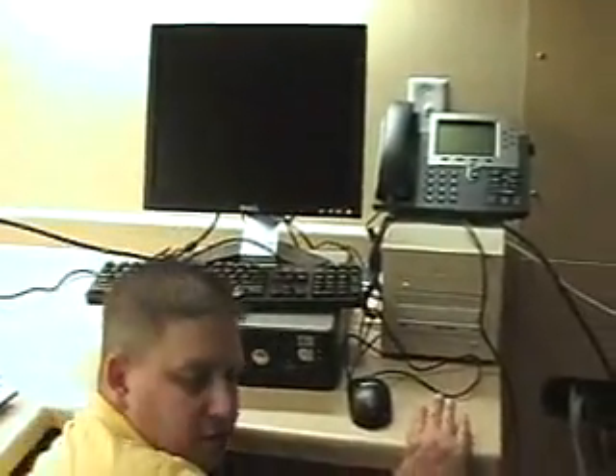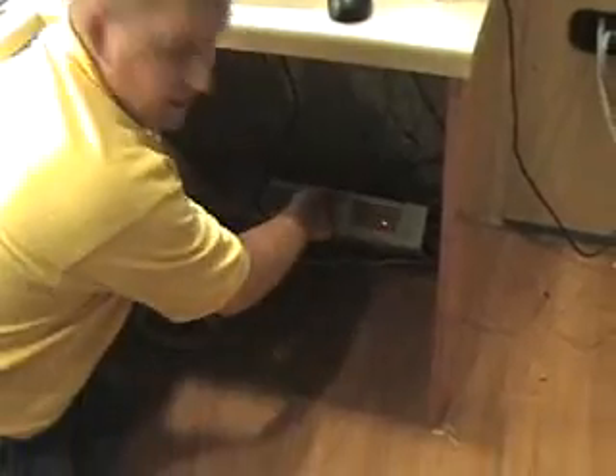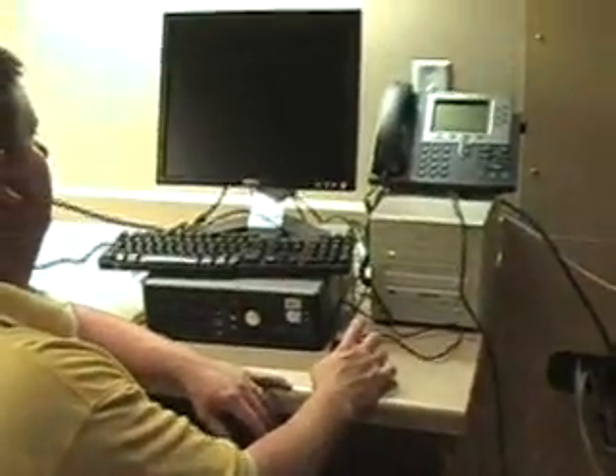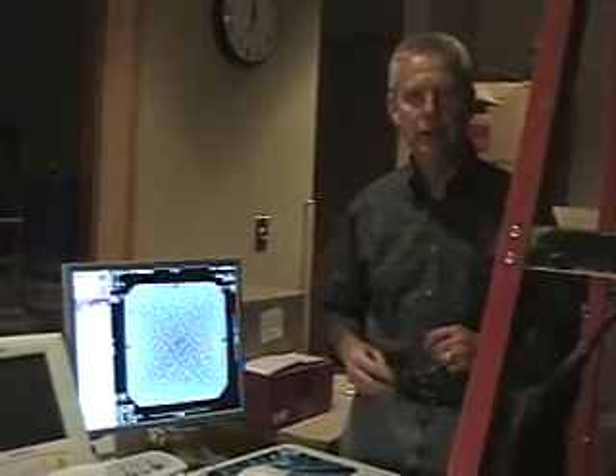While we're powering everything on, switch the power supply on as well. When you turn the power supply on, what you want to see is a red glow inside — that tells you the power supply is on. If it's flashing or chirping of any sort, you know you have the serial cables in the wrong spots. All the lights are on. Once the power supply is hooked up and turned on, take a walk out into the CT room and make sure a red LED is lit on every one of the arms — that tells you your power is hooked up correctly.